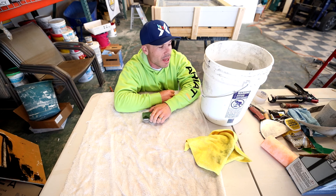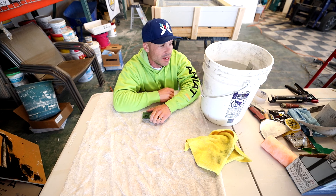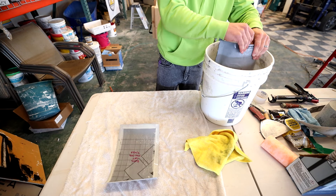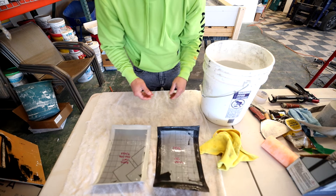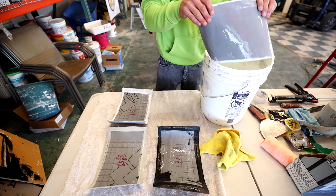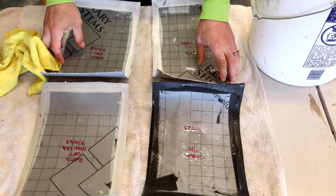There are our four samples — we've got the black one on top, two KERDIFIX, and a Rapid Set. The interesting thing about this sealant is that just by adding water it speeds up the curing process, so they're not even smearing anymore from the water. Welcome back — it is Friday March 17th and we are ready to take our samples out of the water. They've been soaking since last Friday and we'll see how the sealants held up.